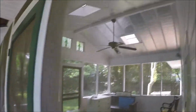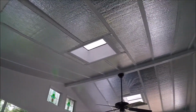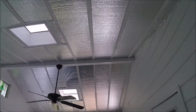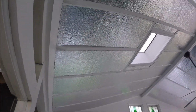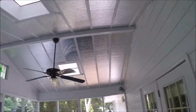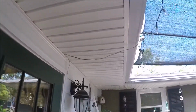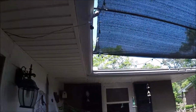Ordered my windows. I got all of my insulation put up here. My 2-inch foam, whatever it is, polystyrene, polyiso. I'm going to tape those joints. Put that all fit like a glove. But my original soffit was not vented. I've just got it vented every couple of pieces around the rest of the house where I've got a power attic ventilator here.